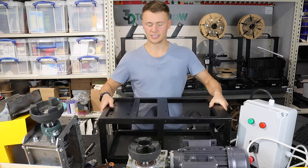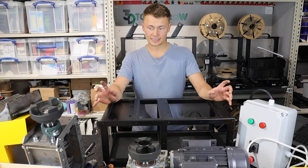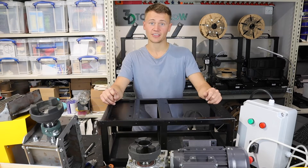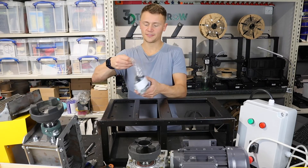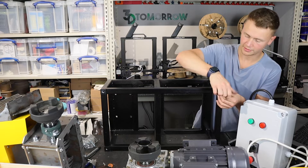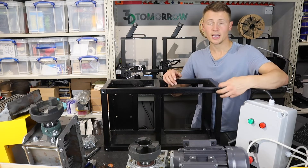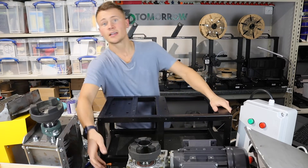Take the powder-coated frame and set it on its side. The instructions recommend assembling the shredder in its final location because even the individual parts are really heavy - and as a complete unit it'll be exceptionally heavy. But I need to make this video, so I'm assembling it on this desk. First things first - add the feet. The frame already has threads in it so we can just screw the feet straight in. These are designed to let you level the frame in its final location; for now I'm just turning them all the way in.